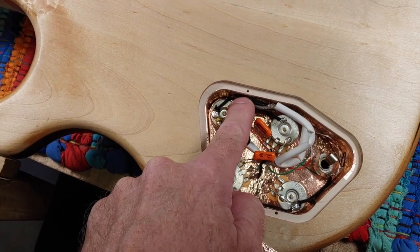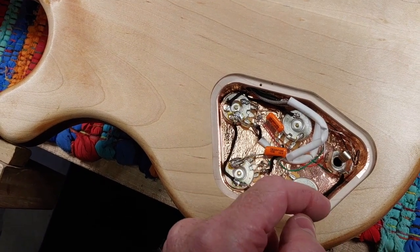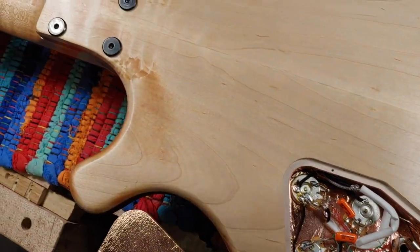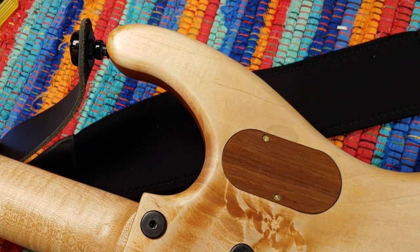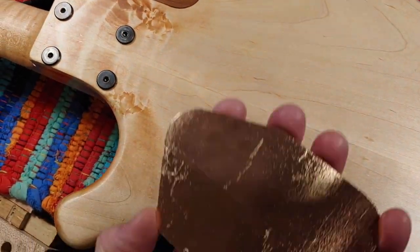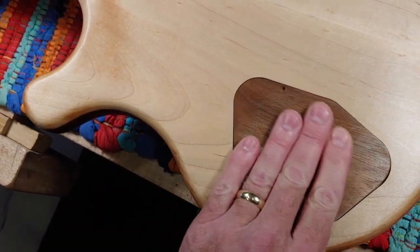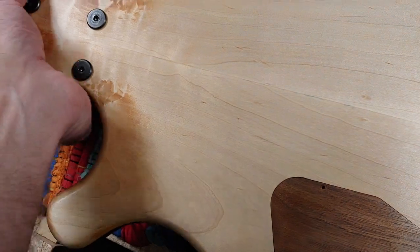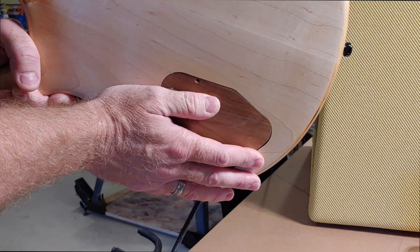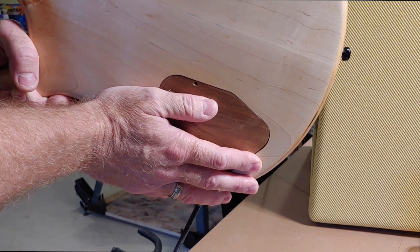So as you can see, I used shielded cable to wire this guitar. The bridge is grounded. I've checked all the continuities. Everything is there. So I'm just not sure exactly what is happening with this thing making so much noise. But merely wrapping all of the electronics into a shielded cage, basically, almost completely eliminated my hum problem. So just opening and closing the cavity cover really makes a difference in how much noise is being generated by the guitar and the electronics.